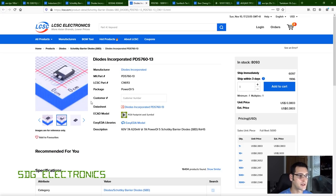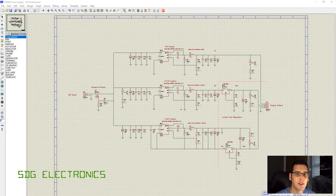We've pretty much completed the component selection, so I'll skip drawing the schematic and rejoin at the PCB layout stage. I've made a few changes while drawing the schematic: the tantalum capacitors for input and output on the DC-to-DC converters have been swapped out for a combination of electrolytic and ceramic capacitors. Tantalum capacitors can fail spectacularly from old age or high ripple currents which reduce their lifespan considerably, so I've eliminated them. Electrolytics don't tend to fail as catastrophically and are easy to swap out.